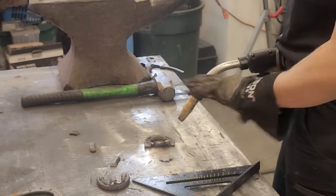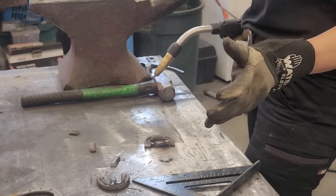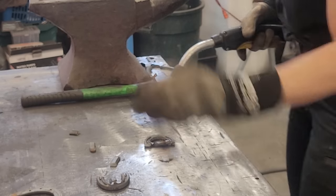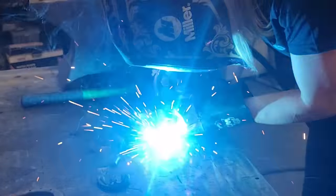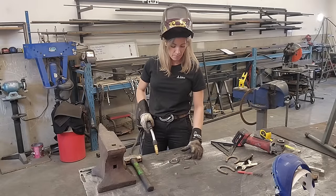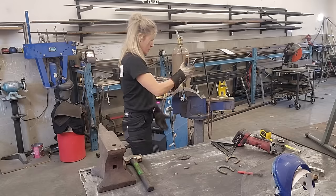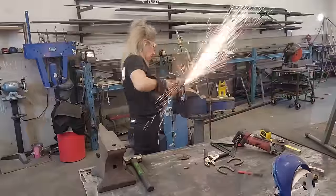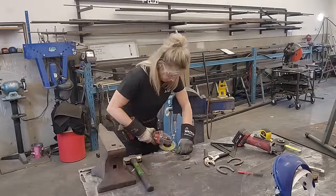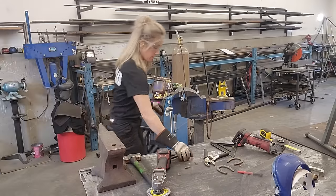With these pieces, you're going to be grinding them to clean them up, so that's pretty simple. You don't need to do one straight solid weld — just giving it spots, letting it cool a little bit so it fills up quicker. I've welded all the spaces — there are no gaps or openings. You have just enough weld on there so that you can grind everything flat and make for a really nice clean-up with the flapper disc. I'm happy with this letter; I have it ground down flat. Now I'm going to do the same to the letter E.